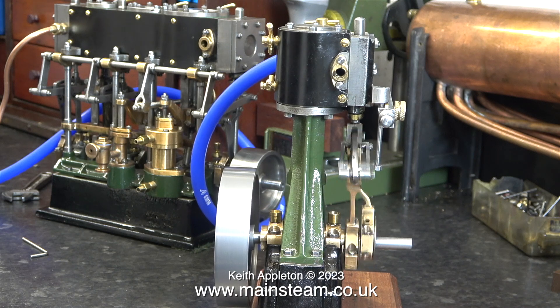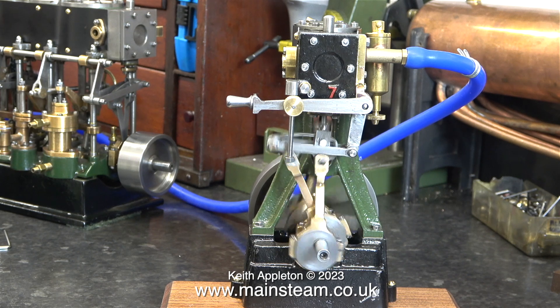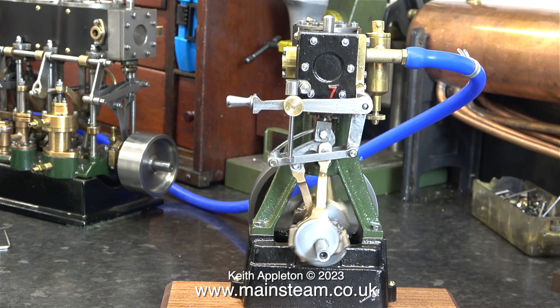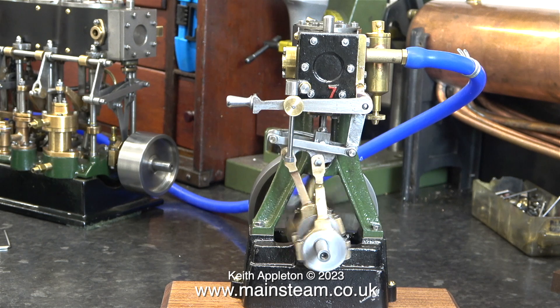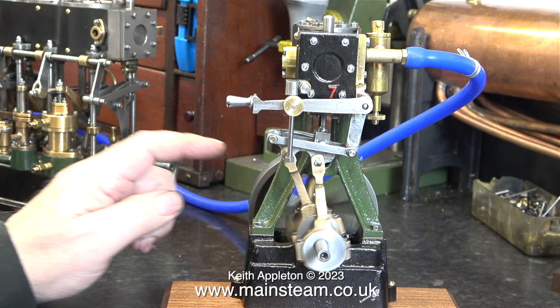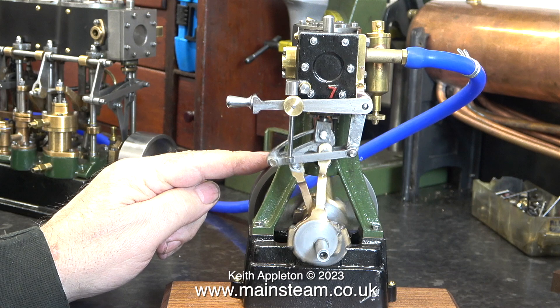I think it's time for a bit of slow motion. It's possibly a good idea to run it in while you've got the wrong size bolts in various places and it's a bit loose and flopping about, because at least it's not going to break. The beats are crisp and quite even. I had to tweak it slightly — I rotated the valve fork one revolution, because I could hear that the valve was not equidistantly over the ports. And now it is, and you can hear the difference.